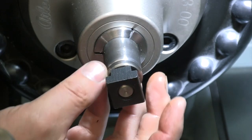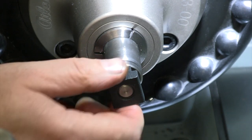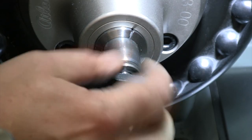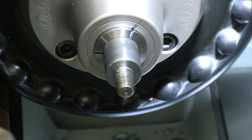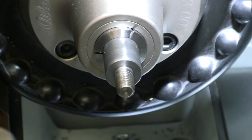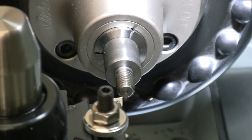So actually, T-nuts are designed so that the threads don't go all the way through them, so you can't screw into your table. So, tried a couple other ones, and they're all fitting the same. So even with that thick washer on there, we just need to face off about 50 thou off the end of that, and then we will be able to have that screw all the way tight. We'll knock about 50 thou off the end, put our bevel back on, and then we'll be good.